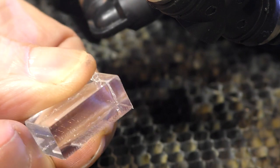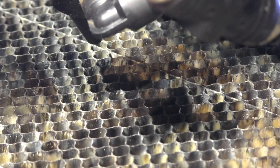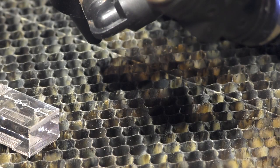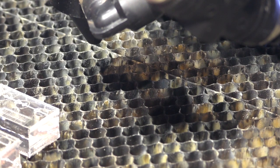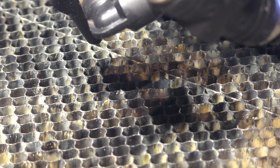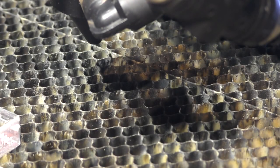And it's cut with a beautifully clear crystal surface. The reason is that just behind the cut, there is liquid at 160 degrees C to 200 degrees C, which remains in the cut and flows across the surface to make the surface wonderfully smooth. So that's a process of cutting by evaporation rather than by chemical change. It's still being done in exactly the same way, by heating up and vibrating the molecules.